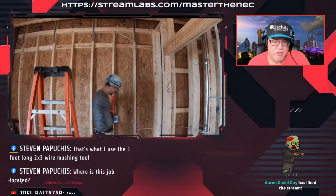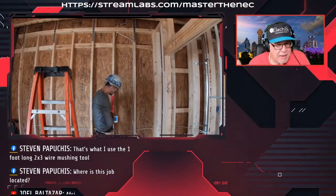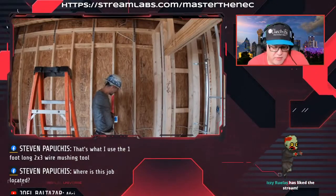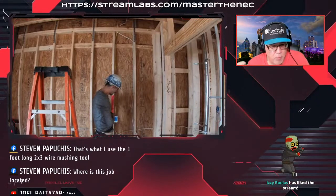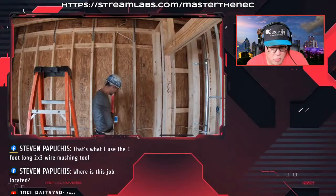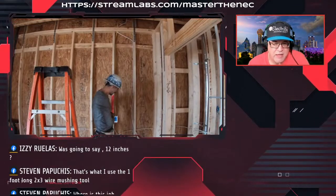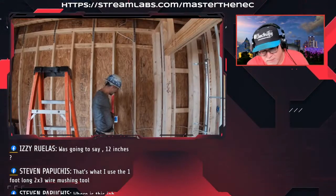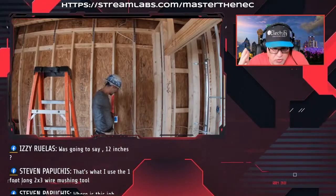That's okay. Just like when he did the panel in episode 4, it might be that his jurisdiction requires that it's within 12 inches of a top plate. That's not what the code says. It is every 4.5 feet. And then again, 12 inches from a box, unless, of course, it's a 2.25 by 4 inch nail-up box with no clamp built into it, then he would have to secure it within 8 inches. Okay, so different rules. But I'm not sure where his top plate thing comes from. It might be local jurisdiction.